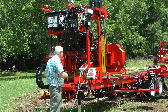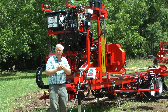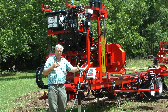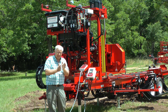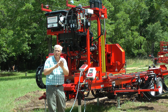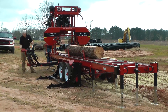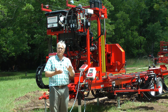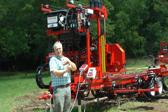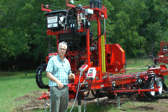In another case where we're going forward or reverse, we don't want a closed center because it stops everything. We want an open center, so it shifts back to neutral. There's a groove around the spool inside that's moving back and forth, and that lets the carriage coast to a stop instead of slamming on the brakes. So we want an open center there so that when we turn it off it has a little bit of coast — maybe 12 inches or so — instead of a hard stop. They have a purpose for whatever situation you need.